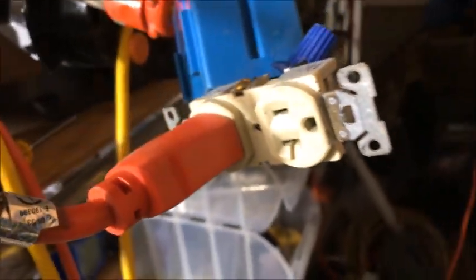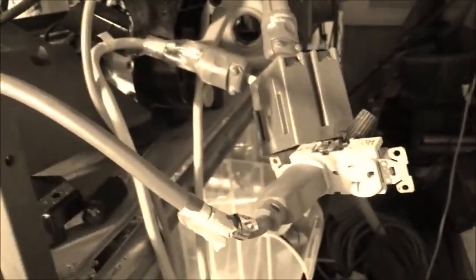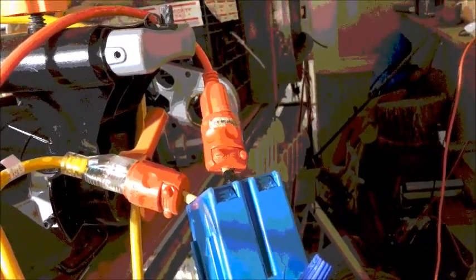Obviously the limitation is you can't plug your 32-amp EV charger into one of these things — or I guess you could, but it would probably only charge for 30 minutes before the breaker trips. Since I checked and the circuit breakers for these outlets are 15 amps, I will probably buy a 15-amp EV charger. A lot of people are going to say the NEC code is rated for 80% of the nominal for continuous loads, but I wouldn't worry too much about that. They have a safety factor of two — for example, 14-gauge 15-amp Romex could safely handle 30 amps before melting, so there is a bit of a safety factor.